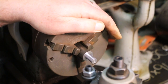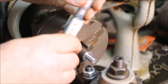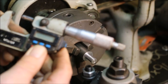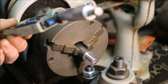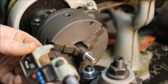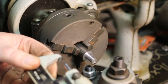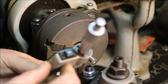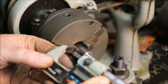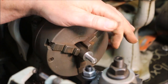If this was a bigger lathe I probably could make the next cut in a single pass, but I'm having to sneak up on it because this is an old lathe with a flat belt drive and it slips. Since this is a digital micrometer — if it had batteries and the thing worked, it would be telling me the dimension right in this little window. But this one was tossed out as junk. Still works, you can still read the dial, it still measures everything just fine, but the electronics don't work anymore. That's okay — I'm more than happy enough to measure the outside and read the barrel. The barrel tells me this is .427, and it's a little warm, so it's probably closer to .426. It expands a bit with heat.